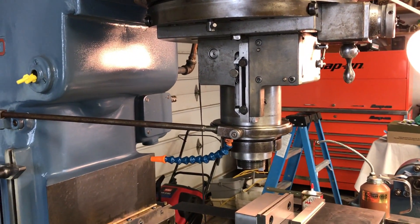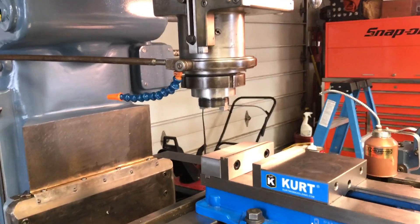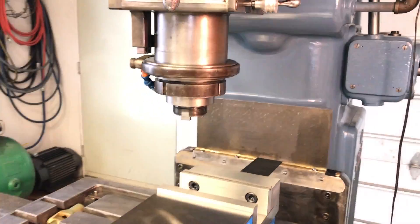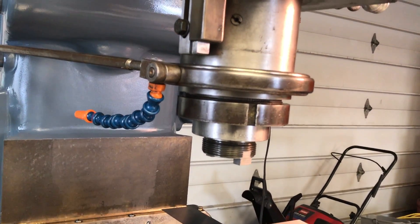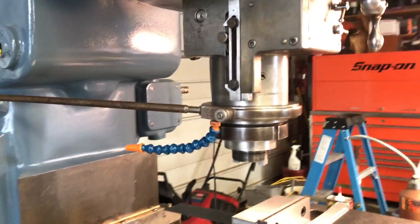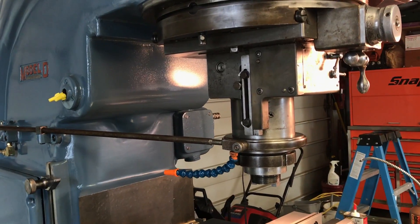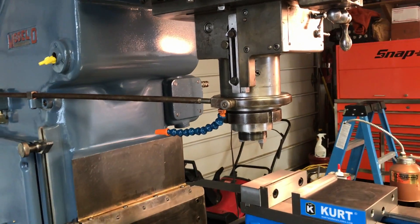This machine actually has a somewhat different sort of taper — it is a 30 taper but it doesn't have a drawbar. It uses a nut that holds it into the spindle, and the factory tooling is a little bit different: it has a slot in the side of the taper that allows drive dogs to go into it, and then a nut clamps up into the spindle. I didn't get that tooling originally, but later I was stumbling around on eBay and stumbled across a tool kit for this machine — I got the 30 taper collets and what they call a 20 taper collet that the tool holder uses. I still didn't get the nut that holds it in, so I ended up having to make that nut.